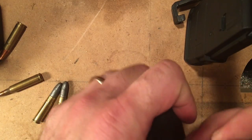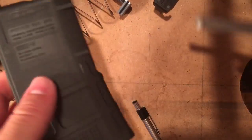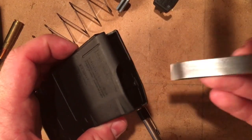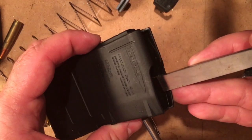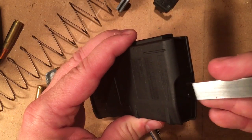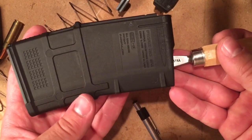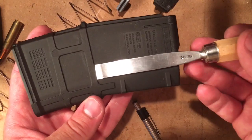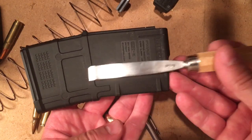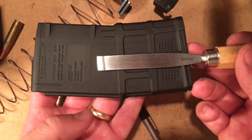What I like to do — what I found works best for me — is use a nice long sharp chisel, like this. It allows you to reach inside with the flat edge, grab the edge of that rib, and obviously being careful — the sharp edge is inside the mag body which protects you if it slips — using the flat edge, go in there and trim it down bit by bit until you get it as low as you want. Just go deeper and deeper. If you're not going to go all the way through, this is only a 20-round magazine and a chisel like this can reach about halfway in. If you really wanted to do the whole thing, you could flip it around and trim on the bottom as well.